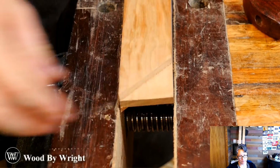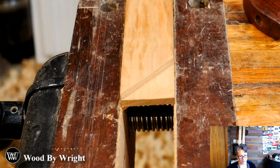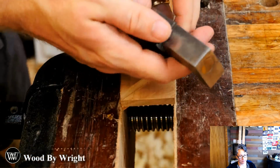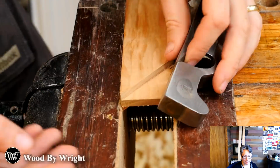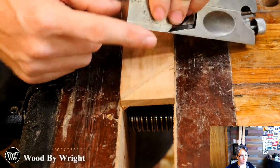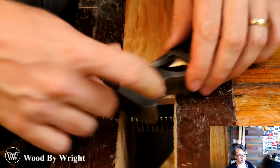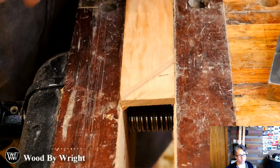We're going to do the same thing on this side, except in this case I want to use a shoulder plane. And this allows you to get right up and close to the edge. And I need to sharpen it. I haven't sharpened that one up. So basically with the shoulder plane, once you get it sharpened and set up, you can put it on here and you can reference this surface of the plane to this surface of the tenon, slide along there, and it will clean it out and give you a really nice clean 90-degree edge from this surface to the shoulder surface.